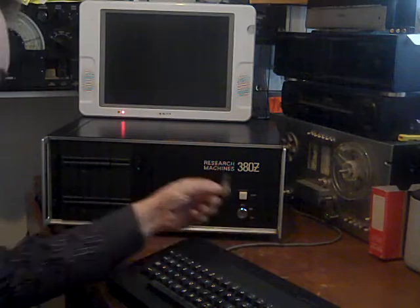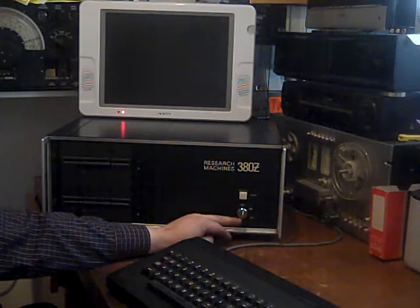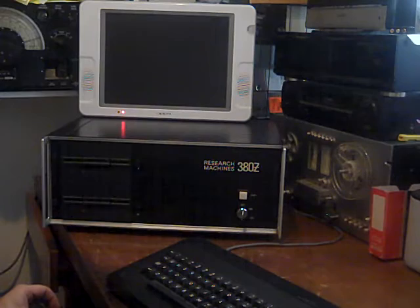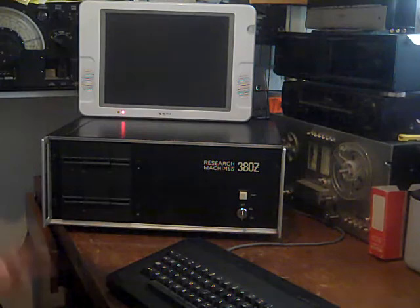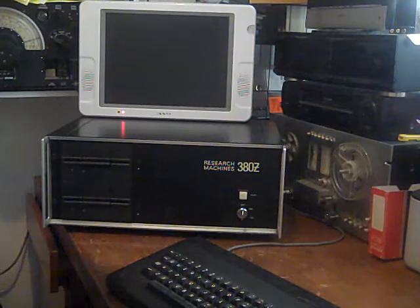I found a key that fit the lock but didn't turn it, so I dismantled the barrel inside the lock, took all the little plates out, and rearranged them to suit that key. I had to take a couple out - it's only got three plates in there now - but the key works. You've got off, on, and lock positions. You can switch it on and then into the lock position, take the key out, and if kids are using it, it disables the reset button so they can't switch it off.